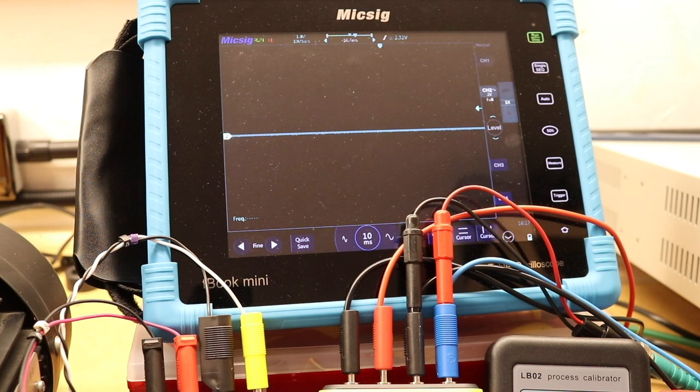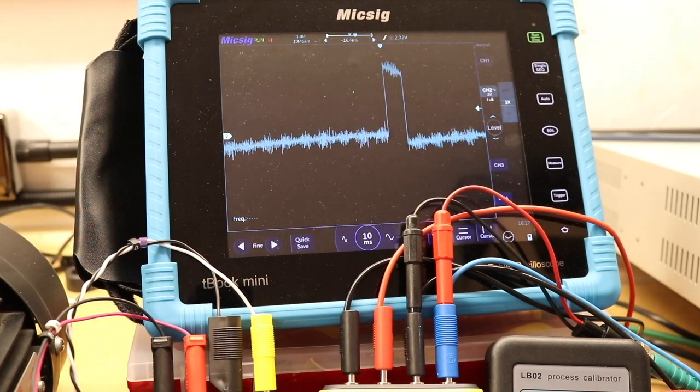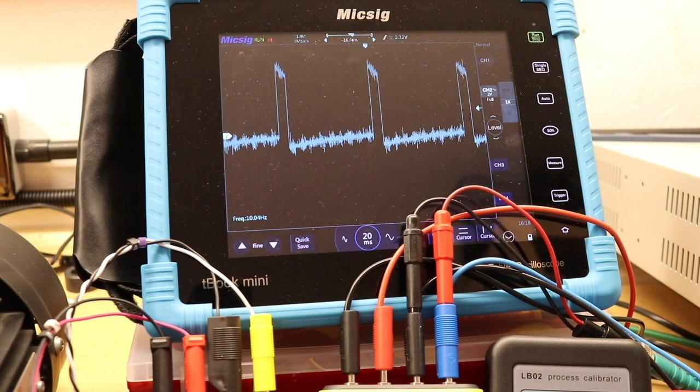Unfortunately I've really struggled to get this working. The first issue is interference, which I believe is being caused by the inverter. I've got an oscilloscope on the input of the SG-003A measuring the switching signal from the inductive probe. Turning on the inverter immediately shows a fair bit of interference on screen, and when the motor is running you can see the signal with noticeable interference on it.